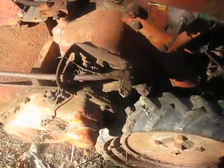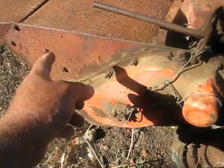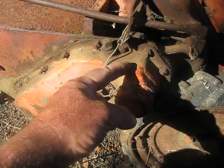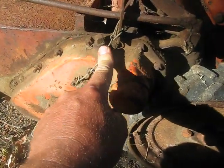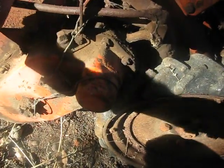The most common problem with these machines is the gear in here. You've got your selector here for the rotor. This little pinion gear here strips — it chews out and wears on an angle, so it keeps taking itself out of gear. As you can see they wire them up, and he must have something bolted in here to keep that gear in, because you can't actually take this one out of gear.